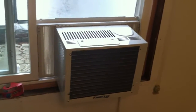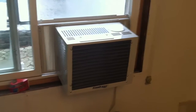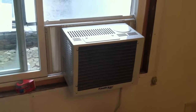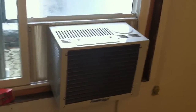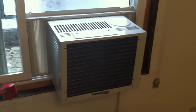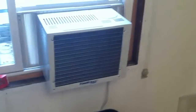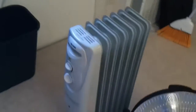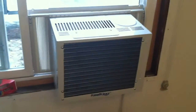The reason for doing this is that the air conditioner actually doesn't take up much power. This particular one is a 5,000 BTU air conditioner, and it only takes maybe about 400 watts running. I have a little kilowatt meter here which I use to measure electricity usage — it can tell me how many watts and the total amount of power used. It only takes up about 300 to 400 watts. I compared that against a standard 1,500 watt oil-filled radiator and found that the air conditioner running as a heat pump could heat the room about twice as fast, meaning it's putting out something close to the equivalent of 3,000 watts of power for only about 400 watts input.